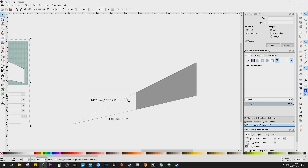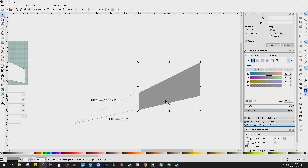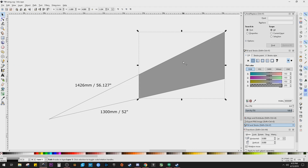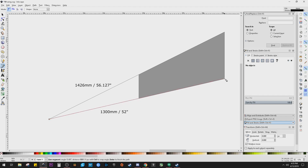The other thing with hot wire cutting that I'll do is I'll take that shape and continue these lines all the way down to where they meet. This point here is going to be the pivot point where I attach my hot wire. Sometimes when you're trying to place the foam in position you'll be pulling your hot wire and you'll try to get this matched up perfectly, and then you bring it over here and it's way off — you adjust the foam to match this and then this side's off. So measuring this ahead of time — I already cut this wing out — I used my measurement of 1426, put the leading edge tip at that distance, lined that up, brought it over, and I just had to play with it for about 20 or 30 seconds and had the piece locked into position with weights on it.